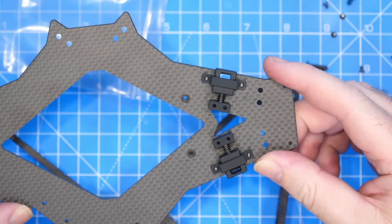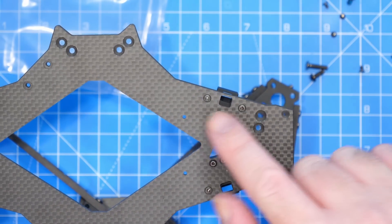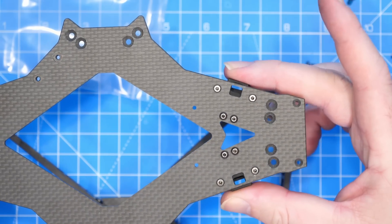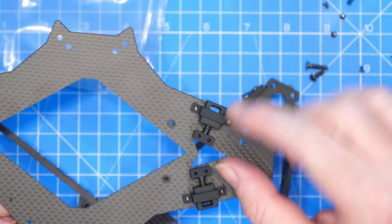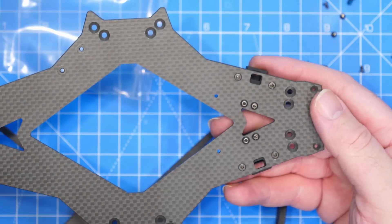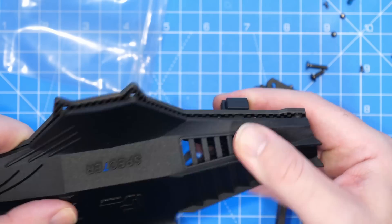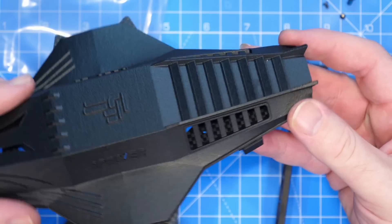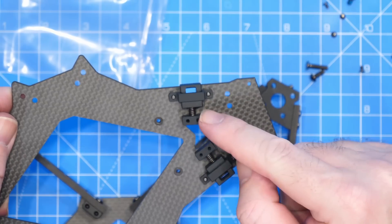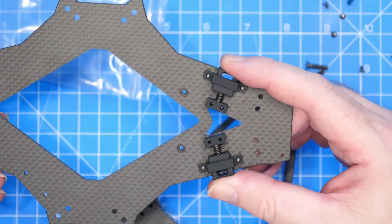I've just worked out what all those bits of metal are — they are clips for the canopy. I've mounted them here like this. I didn't actually have enough of the countersunk screws so I've used some standard ones there. What you have is these two clamps that push in — you've got the back piece, and there were two springs included with the kit. It's a locking mechanism for the back of the canopy: the canopy comes down and locks in like that. You press the two buttons and release it. The spring goes on the prong and that goes into the hole in the back — it's a really clever latch system.